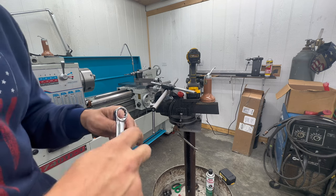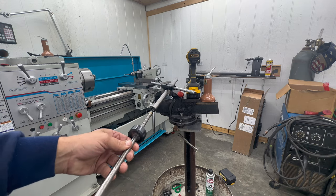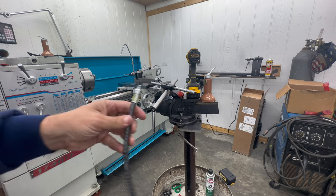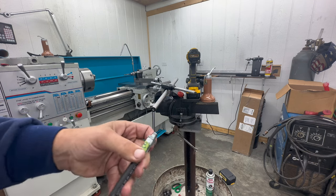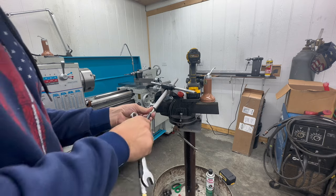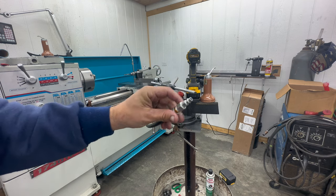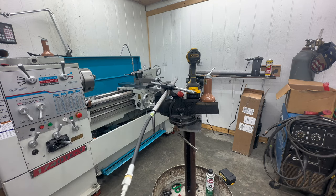Since getting the Haas I've switched up my oil flush system. I used to press a fitting against the barrel end which sealed great, but once pressure built up some would leak. I got tired of that so I came up with a new solution — eighth inch pipe thread that just screws in here. I've got sixteenth inch pipe thread fittings on the way so I won't have to drill such a big hole. Once tightened up, it definitely will not leak. Then I couple it to my oil rotary union with a quick coupling on the lathe.